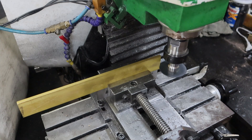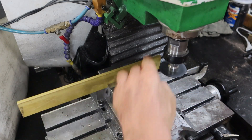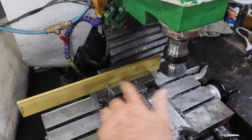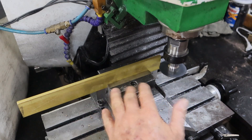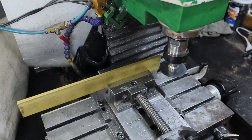I'm going to have to slit it in half. The throat on my bandsaw is not deep enough to cut 150mm because that's a 300mm piece — it's a little over. So I'm just going to try and slit it halfway up with the slitting saw, and then once I've slit it halfway I'll loosen it off, slide it across, and finish slitting it — or flip it around or whatever.